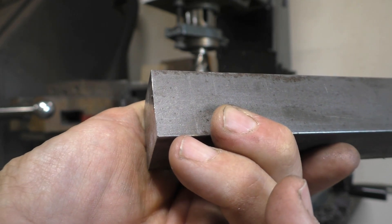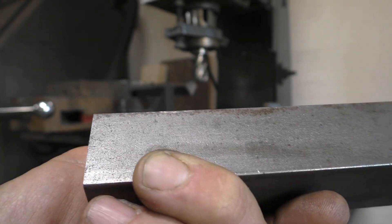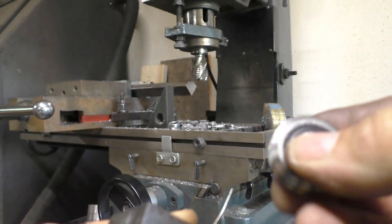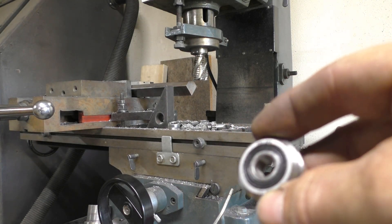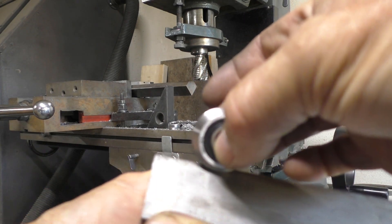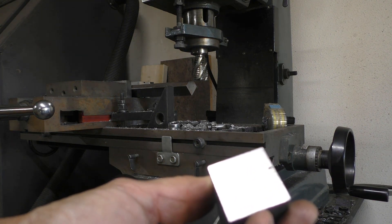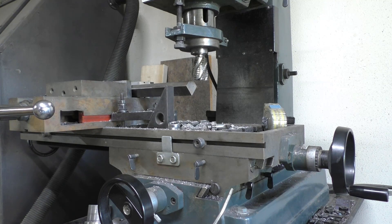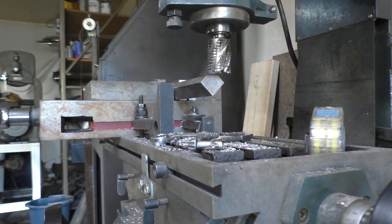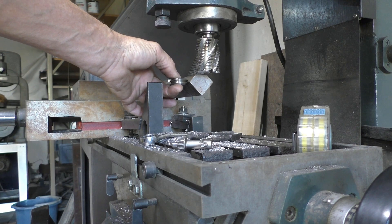For the opposite side of the saw I needed an adjustable guide — one that can be moved in and out to keep the amount of blade in the cut as short as possible. I'm going to use inch-and-a-quarter square material, and I have these bearings with a V-groove in them: two on top and one adjustable one on the bottom, that allow this rail to slide in and out. I didn't really like the diamond profile though, so I'm going to mill it down — cutting the top off flat and possibly the other side too, down to a total of three-quarter inches thick.